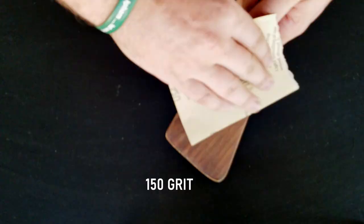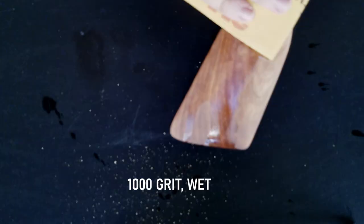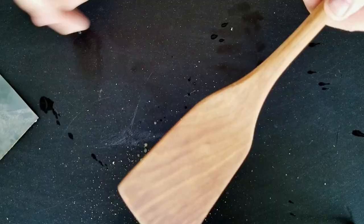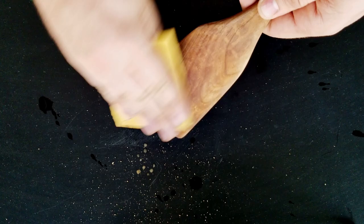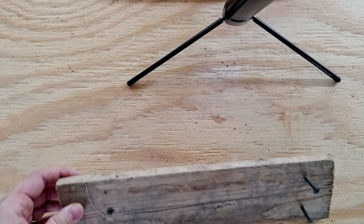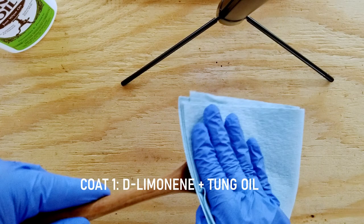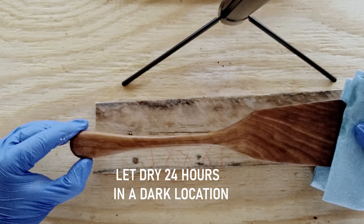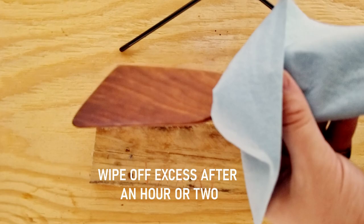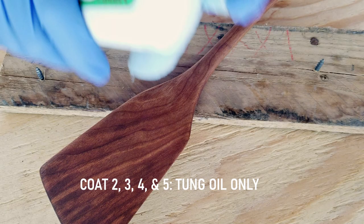Tung oil is a very tricky, time-intensive finish to get right — if you don't follow the instructions you can get an inferior finish that does not seal properly. First I'm going to sand this left-handed spoon down starting at 150 grit, then 220, moving to 400, then 1000 wet. 1000 is probably overkill but I love how smooth it gets. Note to self — keep the sanded spoon away from ink. Now I have to re-sand to get that magenta out. Time to whip out the tung oil. I'm going to do one coat with 50/50 tung oil and d-limonene, a natural solvent that thins out the tung oil and helps it penetrate the wood. Don't ever buy anything that doesn't say 100% pure tung oil — companies will falsely advertise tung oil when it really contains non-food-safe additives.